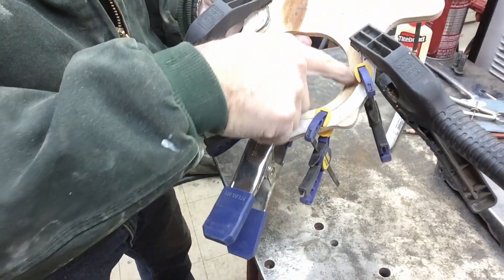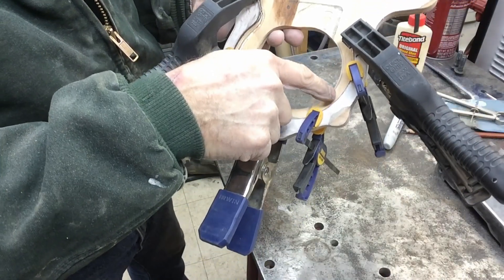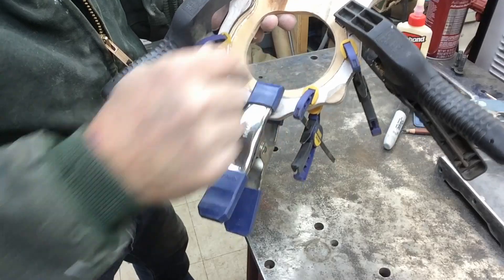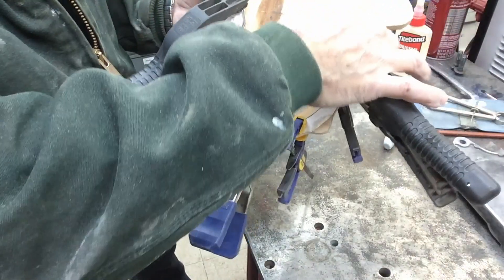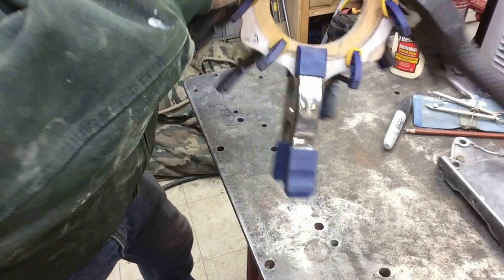This inner contour will need some filler in it. I didn't allow any extra space here for the angle of the draft that goes on the inside around this area. So we'll go ahead and build that up once we get that far. Anyway, we'll let this dry and then go back, clean it up a little bit more, and sand it out.